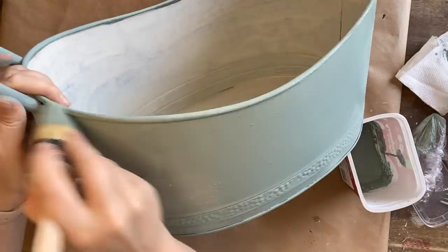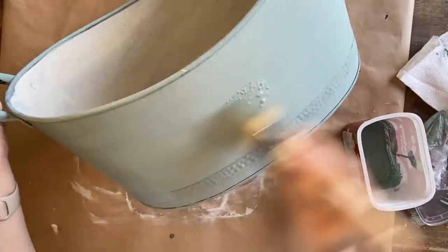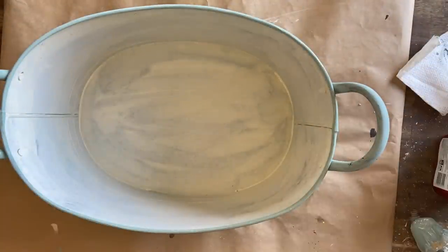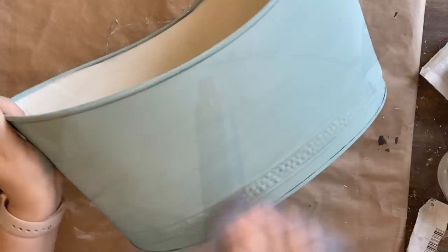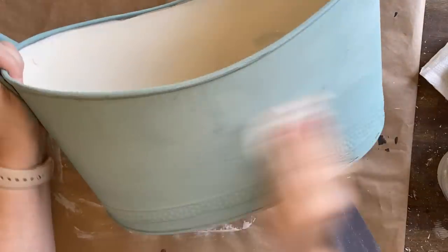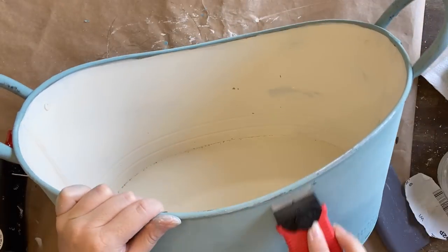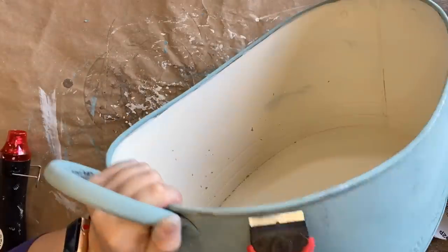Now I'm applying my second coat of the sea glass paint and I'm going to actually be speeding up the drying process using the heat gun, because remember this is the layer we want to have that crackle and distress. I'm focusing the heat gun on the areas where I think a lot of the wear would occur — obviously around the edges — and then coming in with some 220 grit sandpaper just to remove a little bit more of the excess paint and get a smoother surface. I'm then coming in with a paint scraper just to remove a little bit more paint around the edges, again where I think that natural wear would occur.